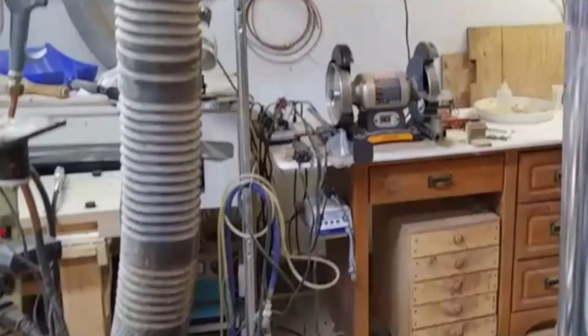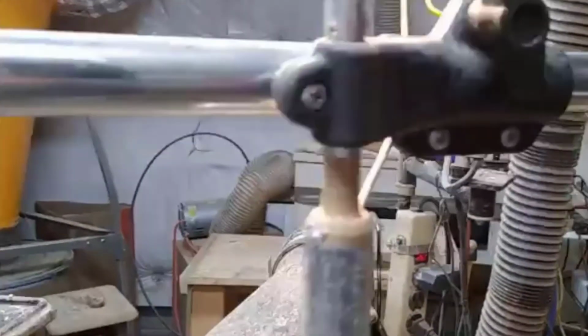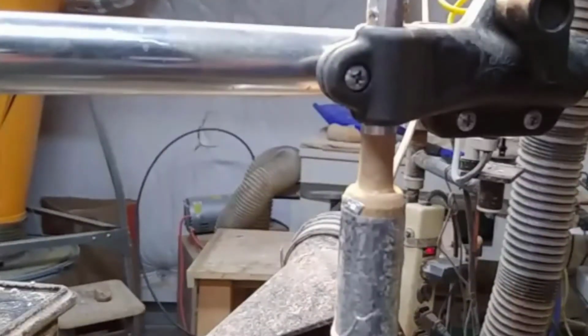This backrest here, the 3/4 inch bar slides in this slot and prevents any torque from causing the tool to rotate. You can still get vibration, but you do not get very bad catches at all. This shaft here goes up to hold the laser. And Jameson sells the laser, and he believes in the laser. He doesn't believe in the camera.